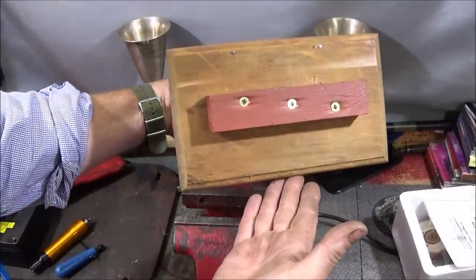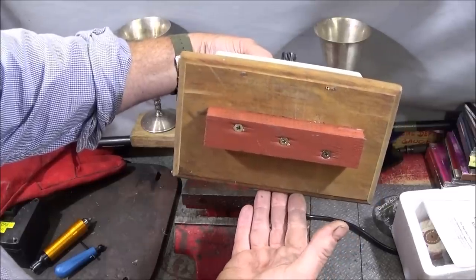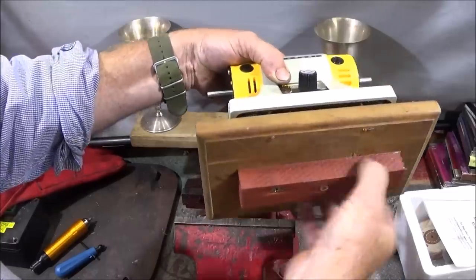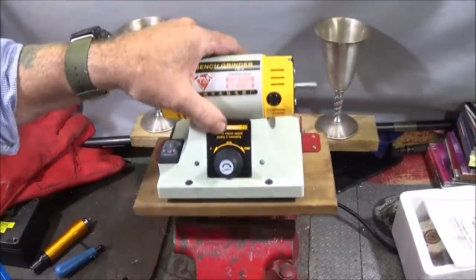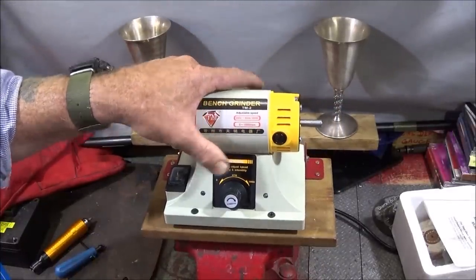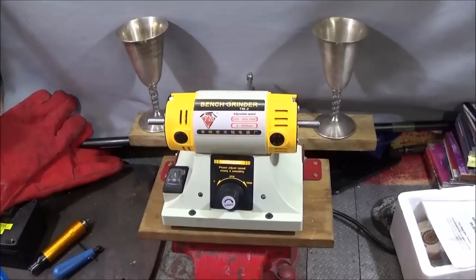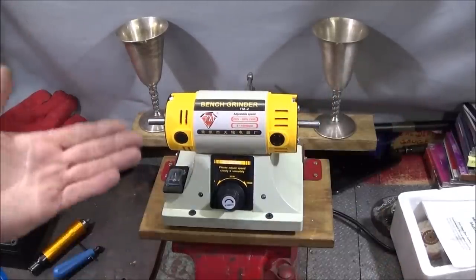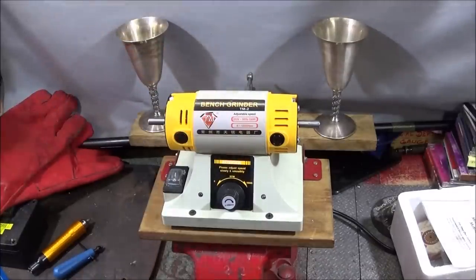This is how I do a lot of my machinery or small machines in the workshop. Because I'm very limited for room, I screw a piece of wood on there with self-tapping screws, and then it can just sit in the vise, and you can tighten it up, and it's rock solid whenever you use it. And being in the vise, it's at a nice working height, and obviously when I finish with it, I just take it out and put it away.